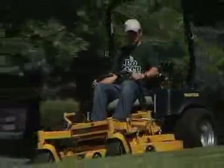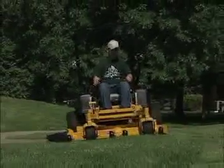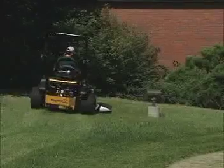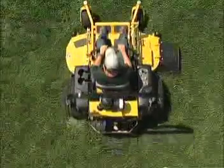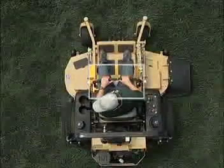When driving a Hustler tractor, smooth, coordinated movements of the steering control levers are the keys to safe operation. Avoid sudden stops or reversals, especially when maneuvering on a slope. To go forward, push the steering control levers forward an equal distance. To go in reverse, pull the steering control levers rearward an equal distance.